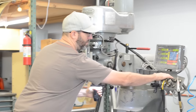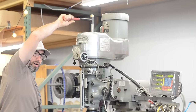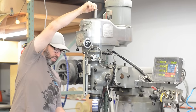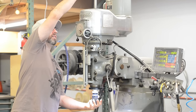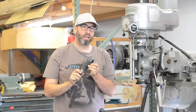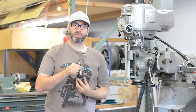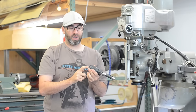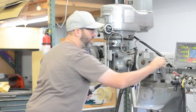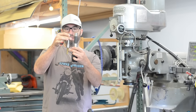If I want to change my collets — I have a bunch over here — there's a draw bar up here which I have to loosen with the wrench. And that pulls out this. This is like a regular drill chuck collet. You only want to use this for drilling up and down, because these collets aren't made to have side-to-side force. When you're doing something side-to-side it's a milling bit — you have to use the milling bit straight into a collet.